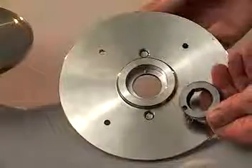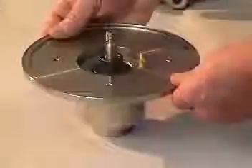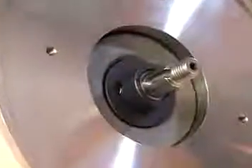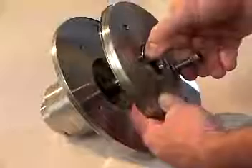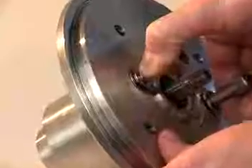Make sure that the bushing pin is in place in the small hole on the inside face of the casing cover. Place the remaining bushing in the casing cover so that the indentation in the bushing faces and fits around the bushing pin. Place the rear casing assembly on its side and make sure that the mark placed on the sleeve earlier is in line with the impeller keyway. Make sure to align the stamped "up" mark on the rear casing with the "up" mark stamped on the casing cover as the casing cover slides into position around the shaft, ensuring that the "up" marks are in line and the mark previously placed on the sleeve is in line with the impeller key.